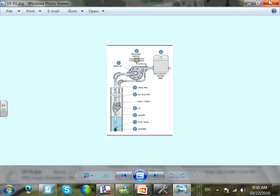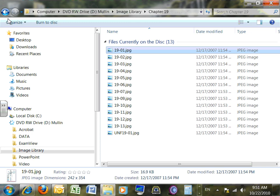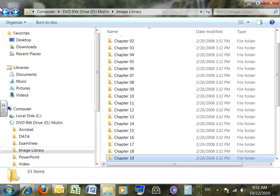Okay, that's what I wanted to cover. Any questions about this? Any question about controlling the loads? So there are different ways: either meter it separately with a relay to control, since they always need some control in it, or meter it separately with a controller, or meter it with the house, but with a controller where you can turn it on and off at certain times.